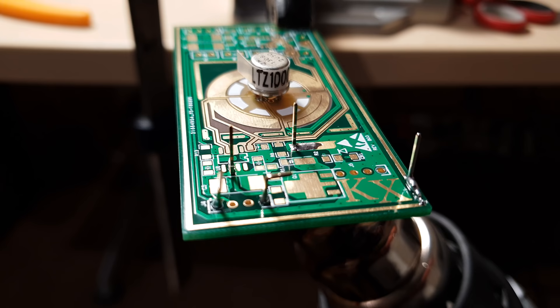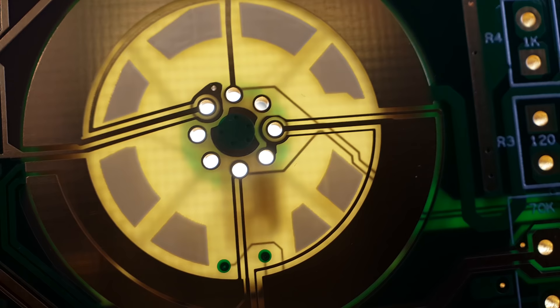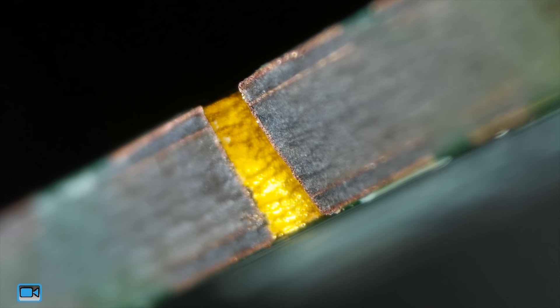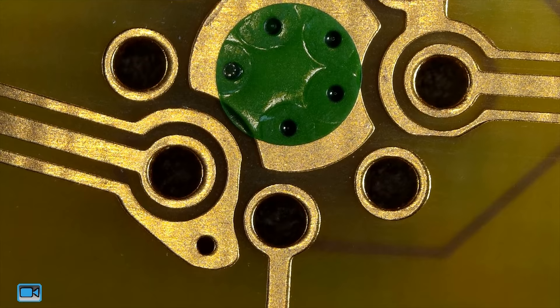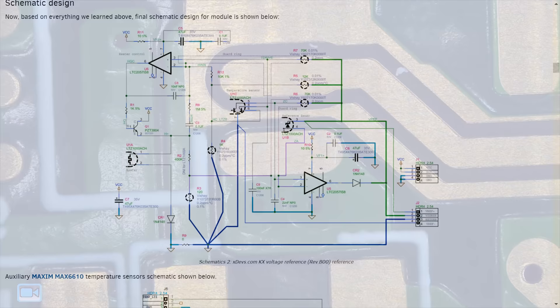My LTZ1000 substitute is more likely to bite the dust than these boards. The prepreg sheets have been bonded properly and evenly. The through-hole and via plating is a bit rough but consistent. Even under the microscope no shortcomings are revealed — quite the contrary, it's looking beautiful down to the last detail, and therefore it's adequate for the notorious circuit that will be based on it. This extraordinary PCB design has been published on xdevs.com along with in-depth information on how to get the best out of it.